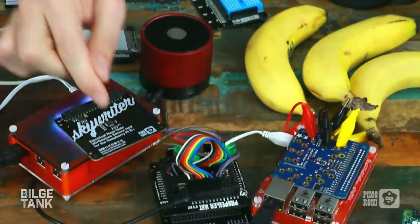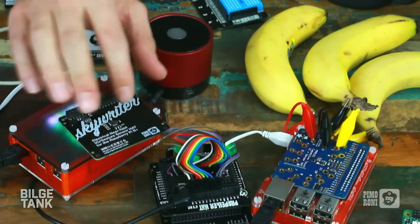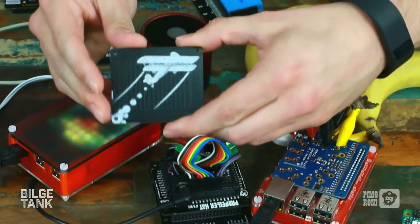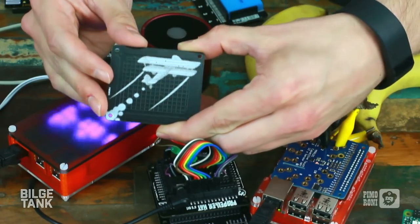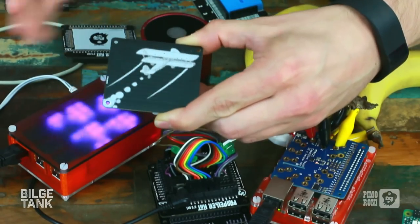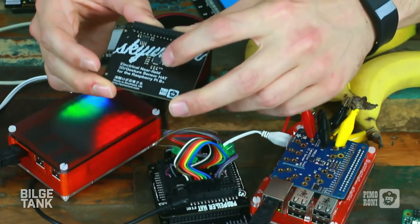This is kind of interesting. It's based on a Microchip part called the MGC3130, which is a near-field gesturing solution. So basically, this is a really basic device, with only one chip on the back and some basic decoupling. But essentially, that chip does some pretty clever stuff. I don't know if you can see some texture, there you go, on the electrodes. It can basically detect the position of objects obscuring a field that is generated by those electrodes, reports it back to the chip, and then the chip can give the information back to the Raspberry Pi.